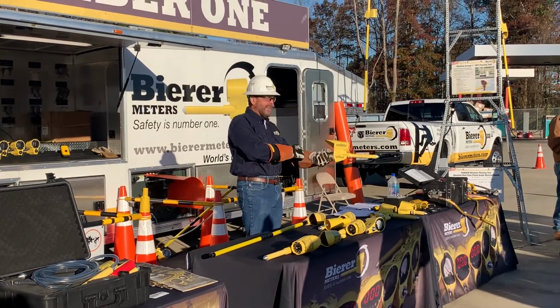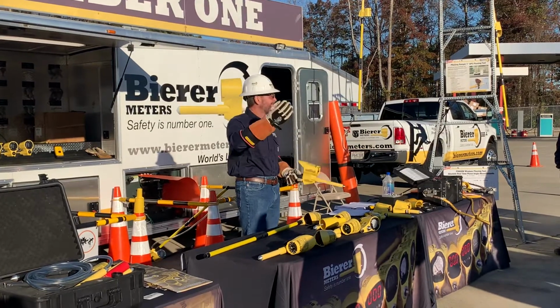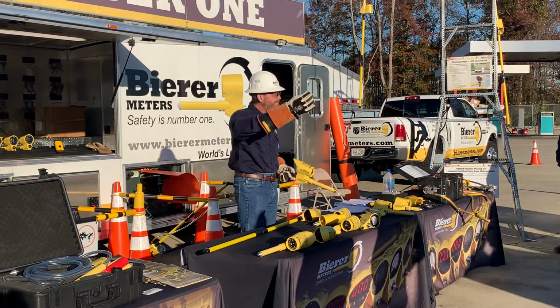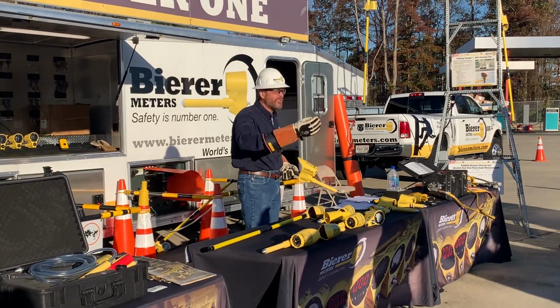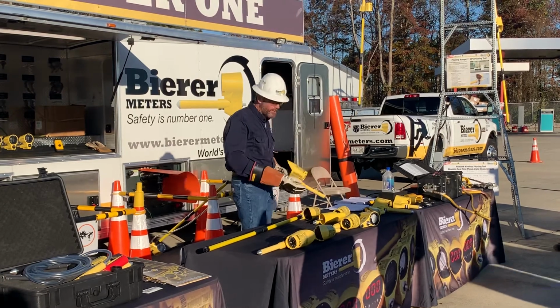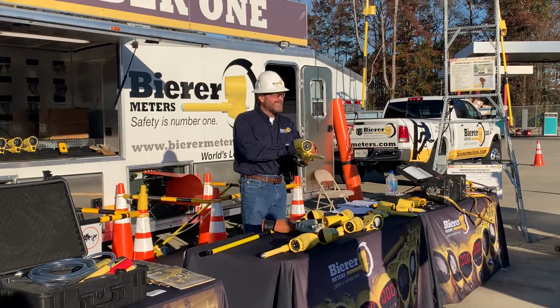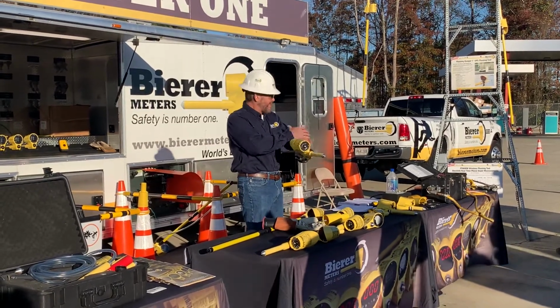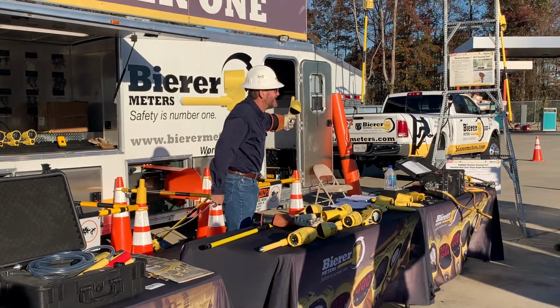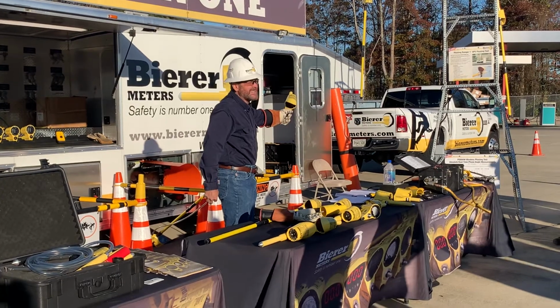If you get your hand right here, these gloves, where are these gloves from? They're from the ground, right? They come from Earth. These couple with capacitance. They're not conductive, but they will couple with capacitance. Well, guess what? This coupling with capacitance right here is right here. Look how close that is to my arm that is conductive. Huh? That's a dangerous scenario, guys.